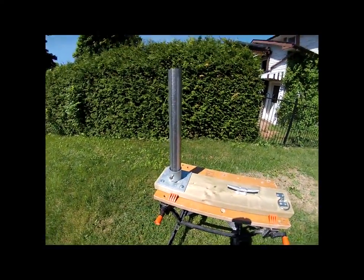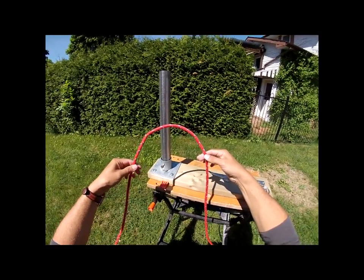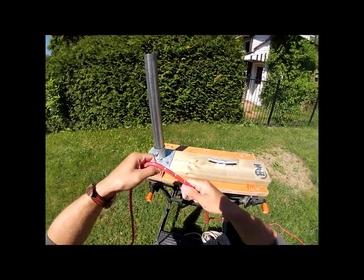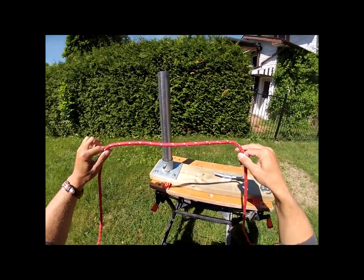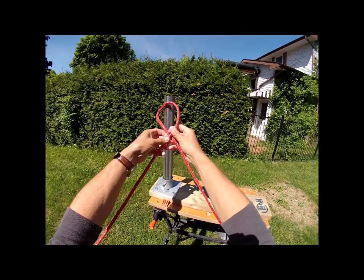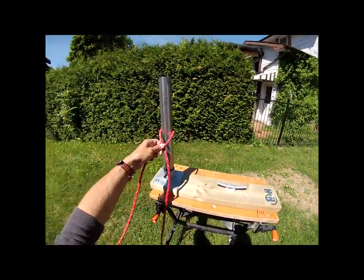If we're working with a post, we're going to work with a part of the line that is an appropriate distance away to keep the boat close to the dock but not tight to it. The working end of the line is irrelevant — it's just going to be set aside. We're going to tie with a spot on the line that gives us the correct distance from the dock. First, make a closed loop, and when you slip it over the post, the part being trapped is the working end — the bitter end — not the part that goes back to the boat.